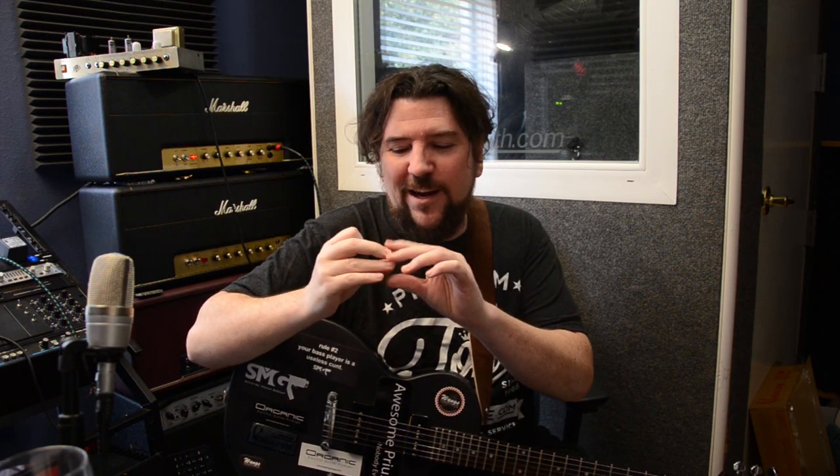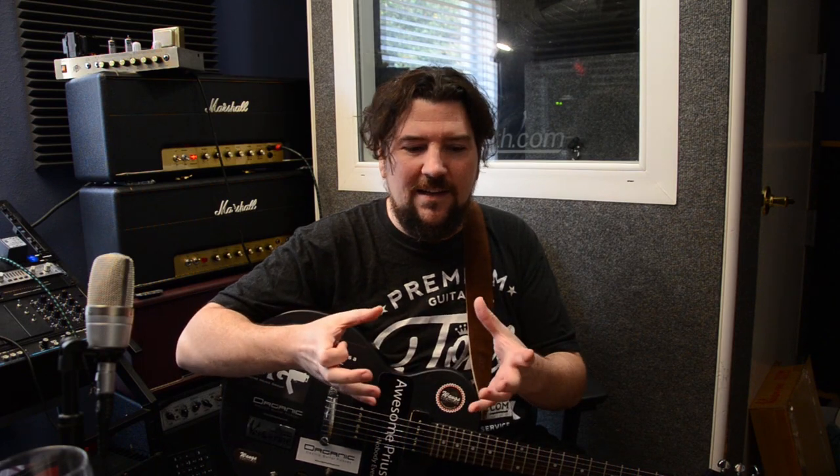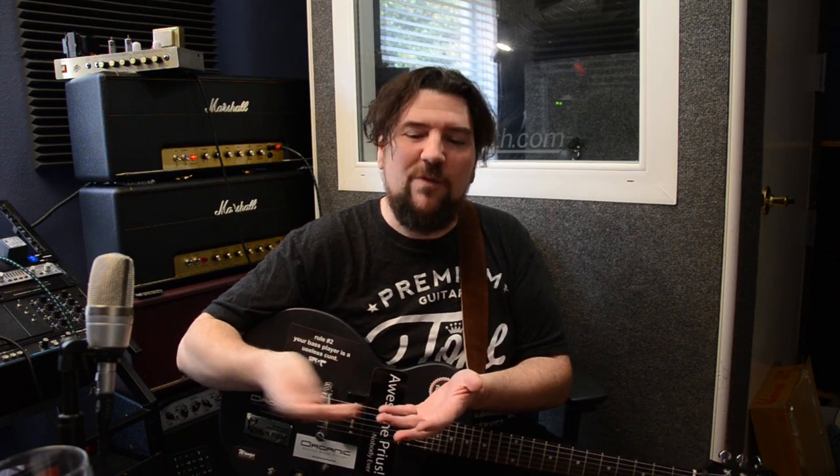I'm obsessed about this stuff. People make fun of Gibson because they recreated the bumblebee caps - they recreated them with fakes, put really cheap caps inside a plastic shell which looks like the old oil and paper capacitors from back in the day. So they don't sound like them. I watched with horror as some guy was pulling apart a 1960 Gibson harness because the pots were 1,000k - 1 meg instead of 500k - and he thought they were broken. They put 700k to 1 meg pots in the tone stack sometimes in the old Gibsons.